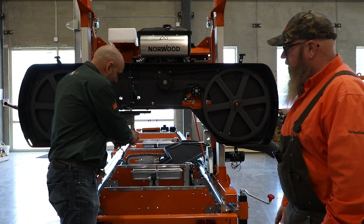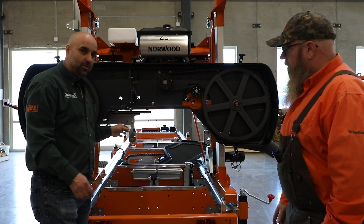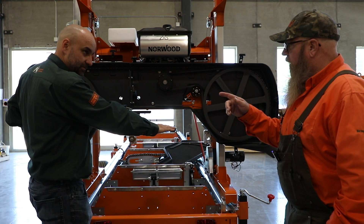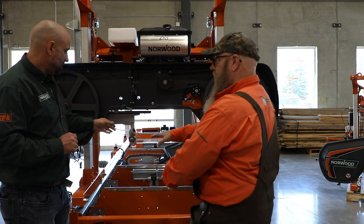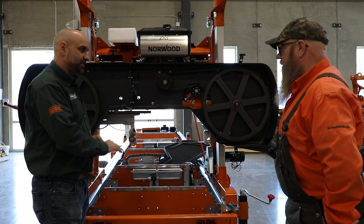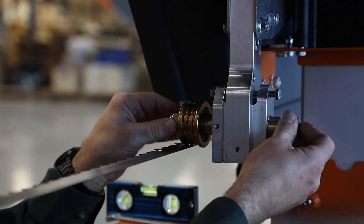When we install them in the blocks, they slide in over top of the blade. You've got an up and down adjustment on this block, and what you're going to do is push down on the blade and deflect it off of being straight across the bandwheels. That's what's really going to give you more stability and a little better control — you're actually coming off the bandwheel and coming down underneath that guide roller. That guide roller pushes down onto the blade. And then with the trunnion style, this shaft can actually tip forwards, up or down.